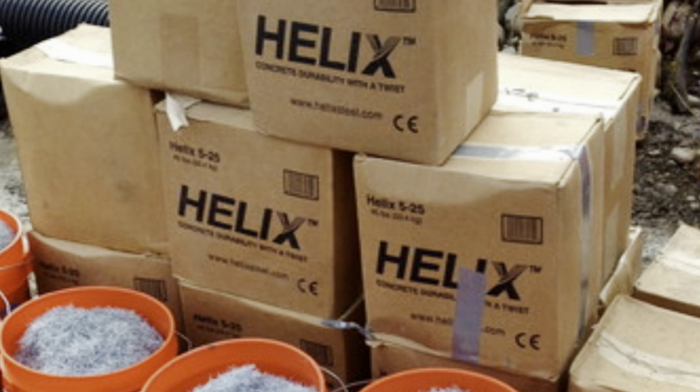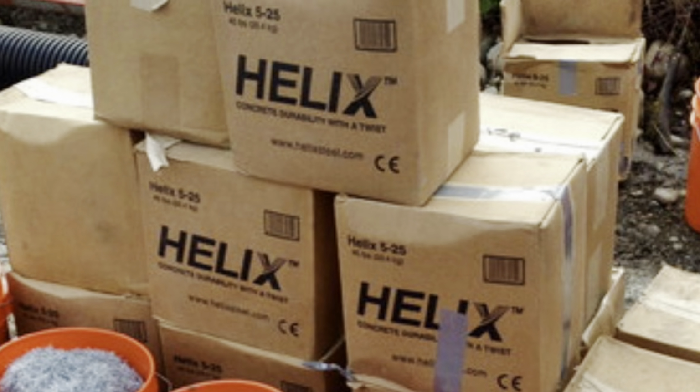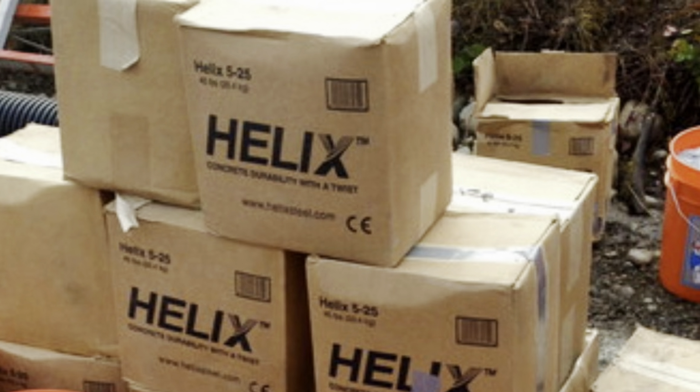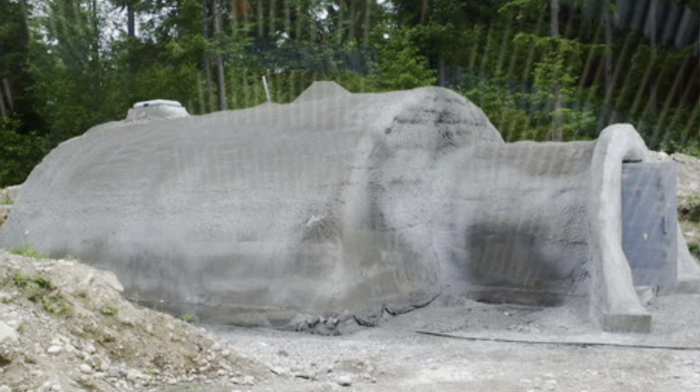And you can see the spray foam on there is quite thick. That green part on there, that's the primer that you use to put on there first, and then you spray foam. This is the Helix steel I was talking about that I put in all the other structures. You mix it right in the concrete. You put like 30 pounds per yard, and it makes no need for rebar. It's not fiber mesh. Here's the support system I use inside that you have to put in before you shotcrete it, because that sucker is heavy.